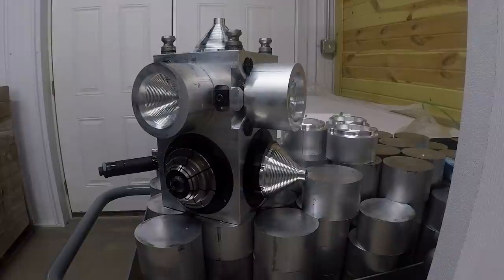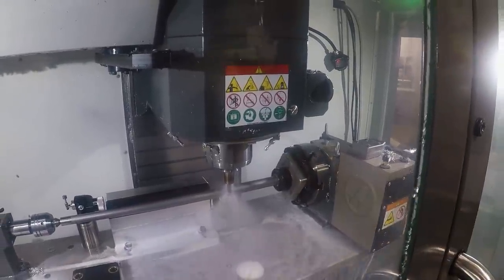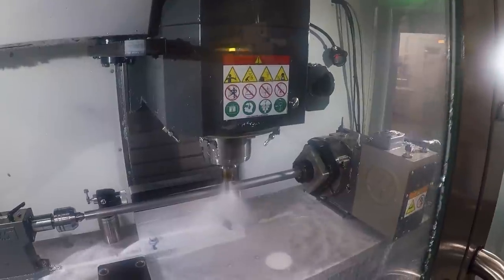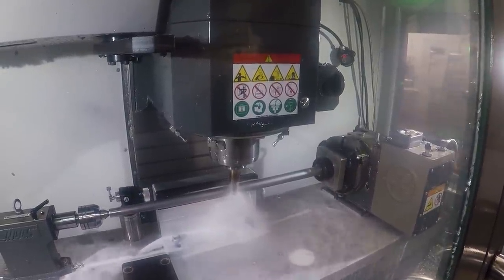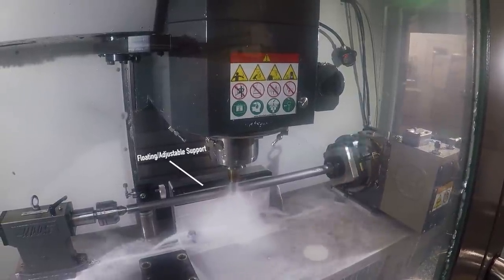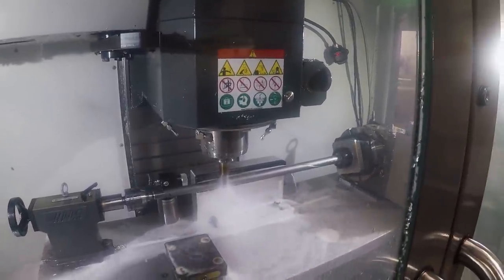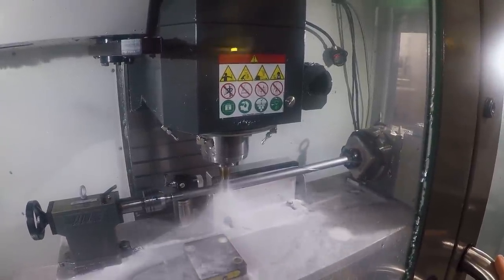Speaking of Area 419, how would you hold a barrel if you wanted to flute all the way along the edge? They've got a really cool setup: on the left they've got a tail stock, on the right they've got a Haas fourth axis with a rock lock base and an ER collet, but the key is a floating or adjustable support that stabilizes the back side of the barrel to minimize or eliminate any chatter as they move the tool along the barrel to flute and cut it.